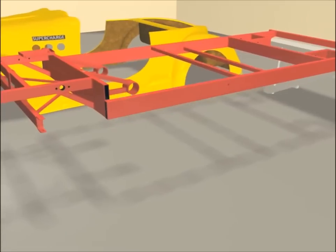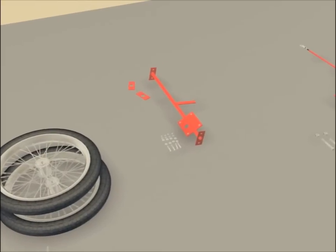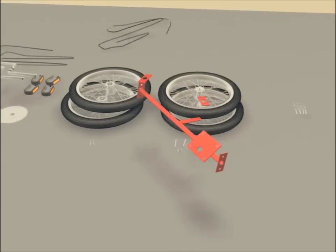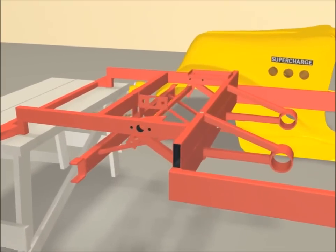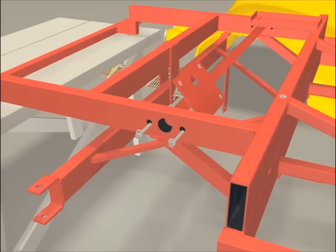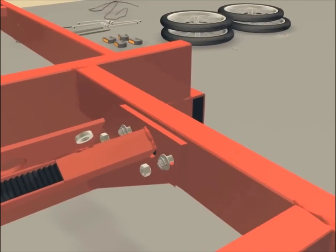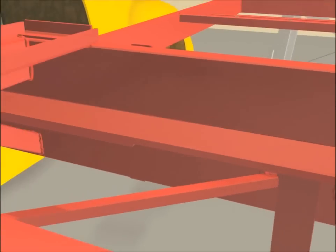Now you are ready to put in the rack and pinion. Included with the rack and pinion are two spacers, four bolts, lock washers, and nuts. The rack and pinion is used to steer the front of the vehicle. It is placed in between the two sections of the frame with a spacer and four nuts, bolted from the inside on both sides of the frame.